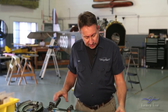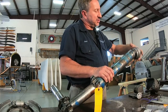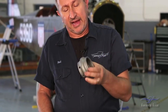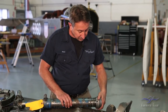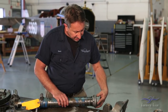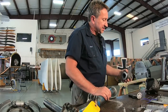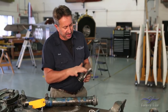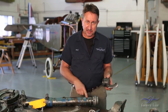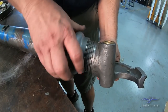It's very interesting how the gear is actually attached to the airplane and how it works. At the very top where it's attached, there is a beautifully machined large nut with reverse threads — one side is right-hand thread, the other is left-hand. This threads onto the gear leg. The next piece that attaches is the little gear piece — another beautifully engineered cast component with a final machining, which has the opposite threads from the landing gear leg and simply screws on. That's how the gear is actually attached — very, very simple, and the gear came off very quickly.